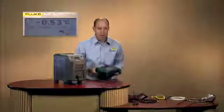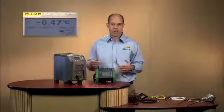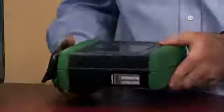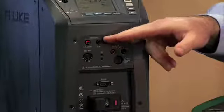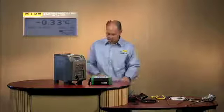First of all, you might be taking a documenting process calibrator out to the field, or a temperature calibrator in which you're needing to measure current or milliamps, and so we looked at replacing that by allowing some documentation features built into the firmware and the ability to measure a 4 to 20 milliamp transmitter in these two ports here. So that allows you to do that. What else?